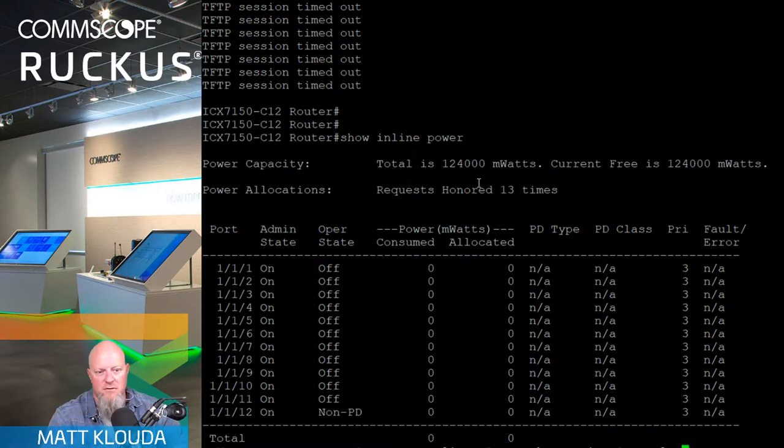they're resolved. So our chipsets, everything, firmware is set. It's good to go. Now, the one thing you can do is, as software is released, and if you're running, say, 8060 or 8070, you can jump to 8090 and get that software. That will actually provide a PoE firmware update, which also gives you some additional stability in that environment. So that's another option there as well, just to do firmware updates. And firmware just helps with the chipsets in there, but everything has been rock solid. So if you have problems, try that. That's a very good thing to try.